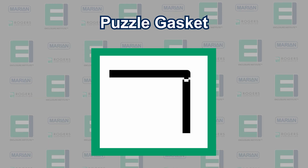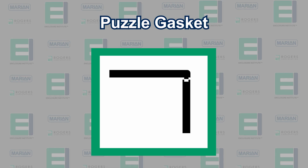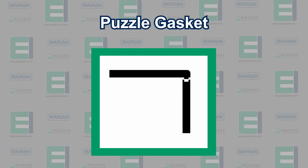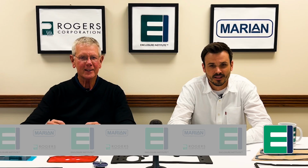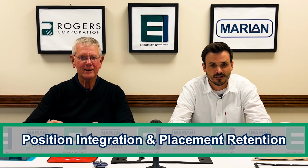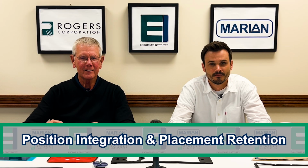Another solution might be what we call a puzzle gasket, where the joints of the gasket parts fit together like puzzle pieces. Any way you cut it, see what I did there, Jimmy? When a gasket is composed of independent parts, the integrity of the seal is dependent upon the proper installation of those parts. Another problem we see occasionally has to do with the position, integration, and placement retention of the gasket.